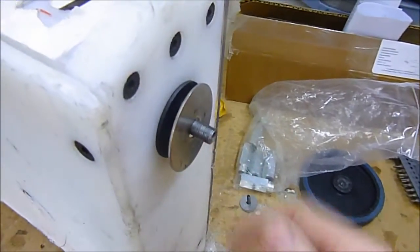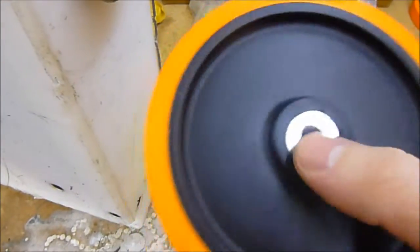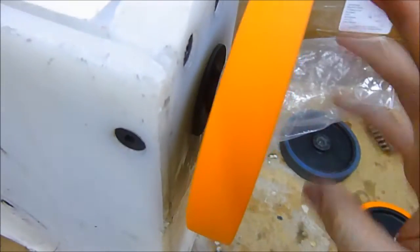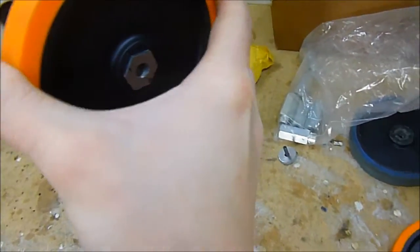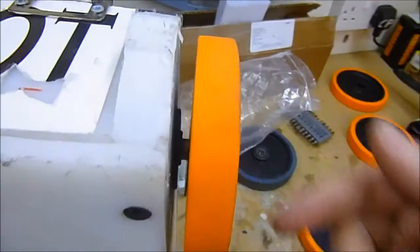What you need on your drill motor output shaft is a washer — quite a wide diameter washer, at least as wide in diameter as the boss of the wheel. I'll show you if you thread this wheel onto the drill shaft. When your wheel's on there, there's still lateral movement, so you can basically just pull it on and off. So having the washer on the inside means the wheel's pressing against that washer and it can't come off the hub.